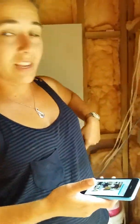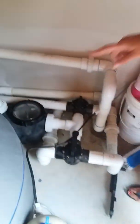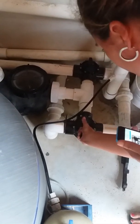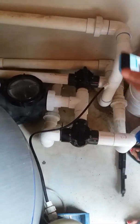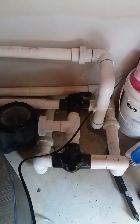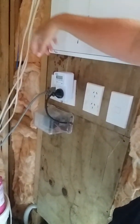Before you put the seal on, you need to change the handles in the pump room first. Turn the pump off again because you can't move anything while it's on. The handles that are currently in filter position — move this one all the way to one side and this one the other way. This is the position the handles need to be in when you're vacuuming. Once that's done, turn the pump back on.